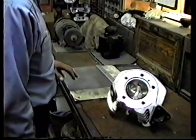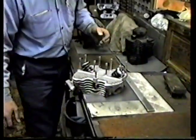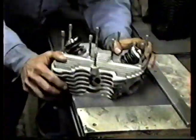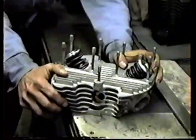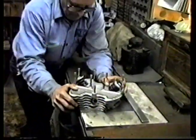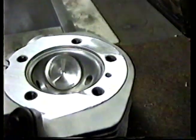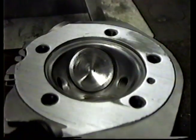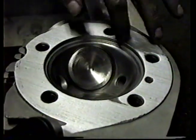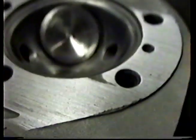We hand-rub them. We've already started rubbing this one a little bit just to see how bad it is, and it's pretty bad. We flip it up and take a look — in this case we've got a low spot here, which pretty much all the shovel heads have right in this area. On top of that we've got a couple of drops by the looks of it — somebody dropped it or did something with it — so we'll have to rub a little harder on this one.